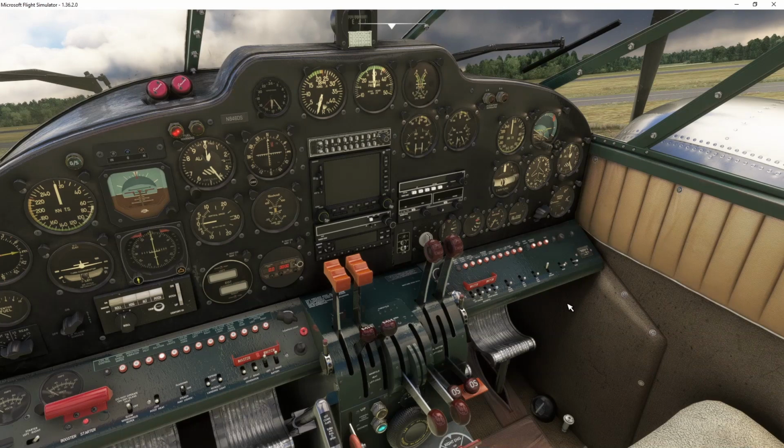And that is just to get the oil circulating throughout the engine, because it is an engine that needs a lot of oil going into this radial configuration. We're just going to get it started with 7 turns. So we're just going to count it generally. Starter, 7 turns, roughly, and magnetos coming on.